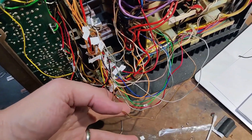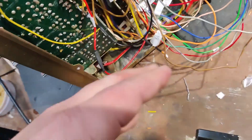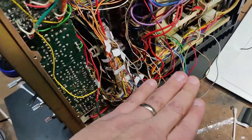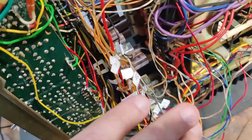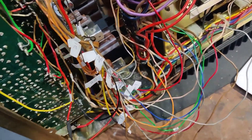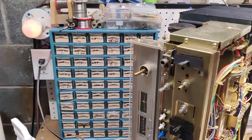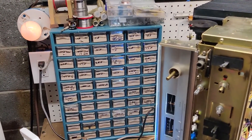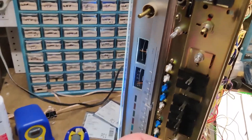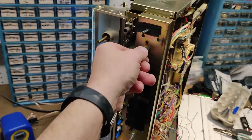Everything is wired in, power supply is back in its home. Cleaned everything up on the wire management — this was a mess. I've organized it for low, mid, and high, so if this ever needs to come out and be serviced, it can exit from the top without needing to desolder, and we'll be able to access whatever we need. Everything is still labeled just in case there's magic smoke. We're going to go ahead on the dim bulb and power it up — fingers crossed. Caps are charging, relay kicked in about 4–5 seconds where it was previously taking 10 seconds. We're good.